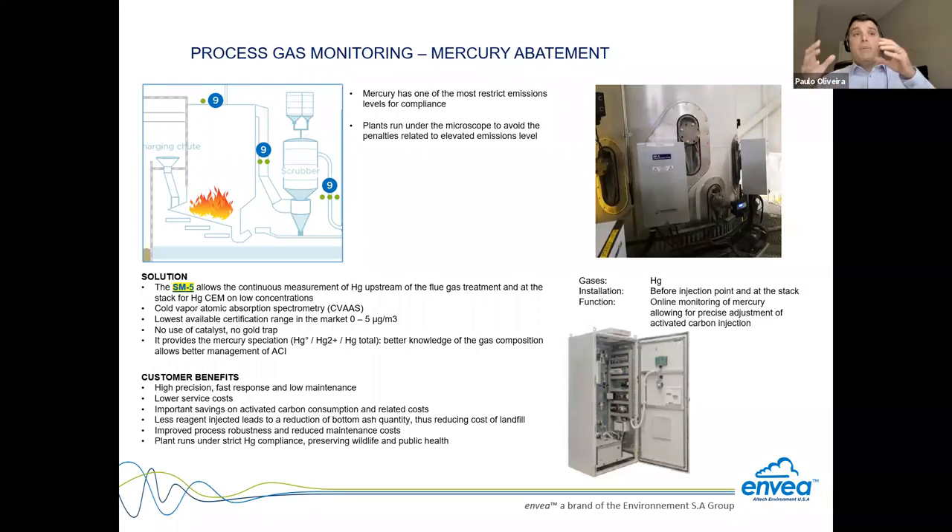This is the second-to-last topic. An audience question from Kevin Redinger: with gas analyzers, is there any impact from exposure to alkaline ash in the flue gas — such as native scrubbing on the analyzer tip — and is there any online cleaning necessary? Paulo answers: we need to know the ash content and particulate level as part of our site survey. It will not be an issue — the analyzers are self-cleaning and we have procedures in place to ensure reliable measurement.